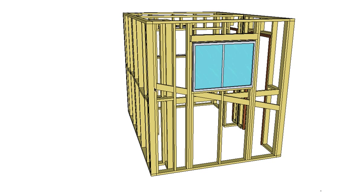and I've also put in some preparatory noggins because on this side of the building, it's simulated that we'd actually have another roof coming in, and the new roof would butt into this building up to this height, and then from here on up we'd have weatherboards. So that's a little bit of a difference on this side. So we've nogged the line we're going to start the weatherboards, so we've got something to put our flashing on and finish it off. So all our noggins are in, all our windows and everything else we need are in, so we're ready to start the process.